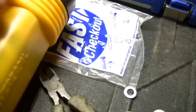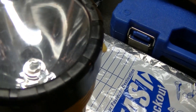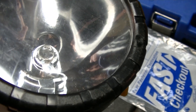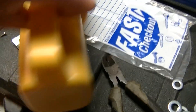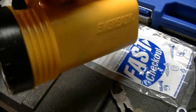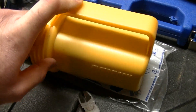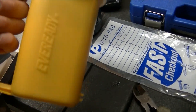Maybe not so much for a 6-volt one like this, and it wouldn't be possible for this one anyway. With these 6-volt lantern batteries, the center contact that goes to the bottom contact of the bulb is negative, and those LEDs need the bottom contact to be positive — so it would not work in a flashlight like this. They did make LED versions of this light, but I know they don't make this particular model anymore, which is a shame because these are reliable, durable, and made in the USA.